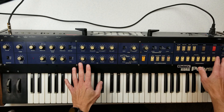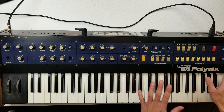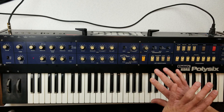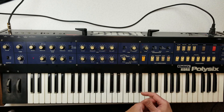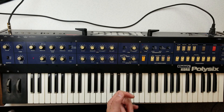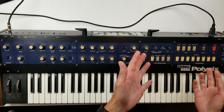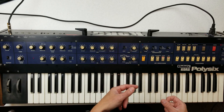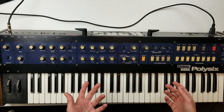We have a whole lot of new functions in here, and they had to shoehorn all the new functionality into the existing buttons. To do that, especially for configuration, we use the Tape Enable button. The tape functionality is gone — there's no way to load and save from cassette tape anymore, which isn't a big deal. So instead, the Tape Enable button is now a Shift button. When it's turned on, we can change MIDI settings, the channel, the clock source from internal or slave it to a MIDI clock, do a factory restore, SysEx dumps, and that sort of thing.